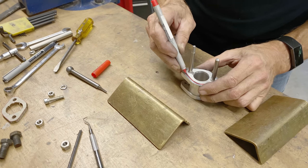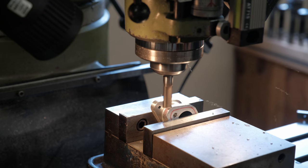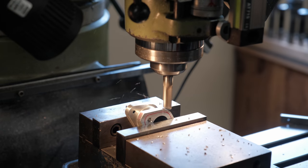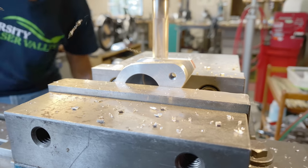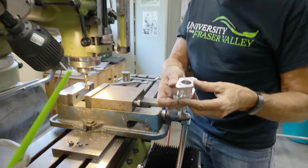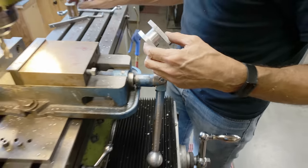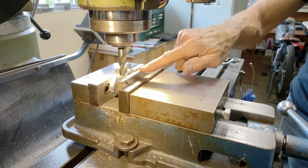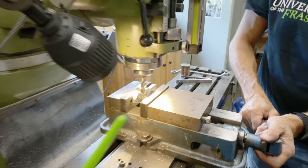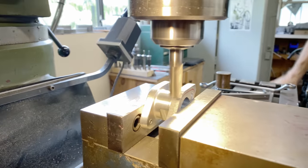That turned out okay — I didn't put any marks on the carburetor for all that filing. Oh, I did touch it right there — very small, underneath too. That was a sweat-inducing job. This template is very handy — it was a template for the fiber insulator and now it's a template for where we cut this. This side is going to be done on the mill with an end mill, and then I'll do a little bit of filing, but mostly end mill. I tried to go right up to the line without going over — I can always file it a bit more.